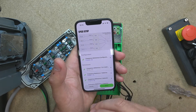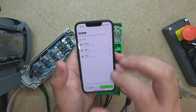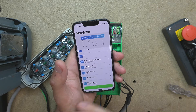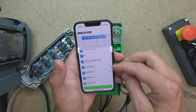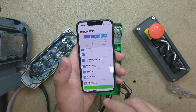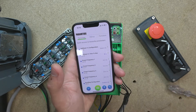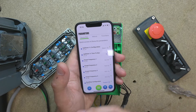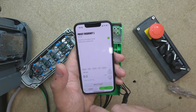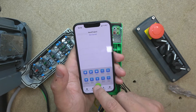I applied this option, and you still need to give it some form of run — run class is speed one. T11 and T15 are already assigned for the binary switches, with reference switch bit zero and reference switch bit one already added in there. I also added a hardware enable for my e-stop, and a run signal which is required for it to run. I put preset speed parameters into my favorites — preset access speed one, two, three, and four. I'm going to change speed one to zero because I don't want the motor to move at all when in run mode.